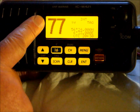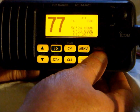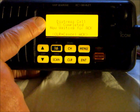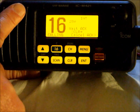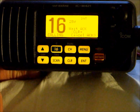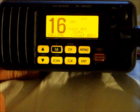At the moment you will notice that the radio is on channel 77 with a power output of 1 watt. This following method works on all DSC radios. Lift the red cover, press once and then press and hold. After about 5 seconds the radio will tell you that the distress alert has been sent. This will activate an alarm in the radios of all vessels in the reception area. You will also notice that we are now waiting for a digital acknowledgement. In the UK this will normally come from the Coast Guard Agency.